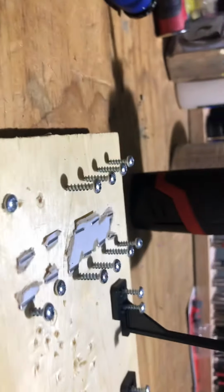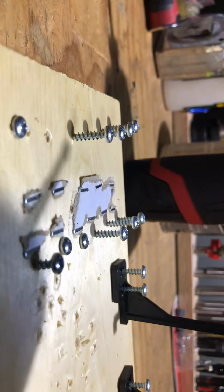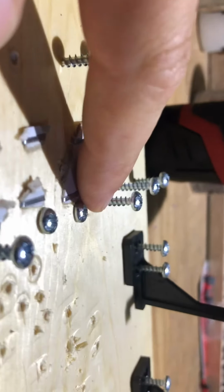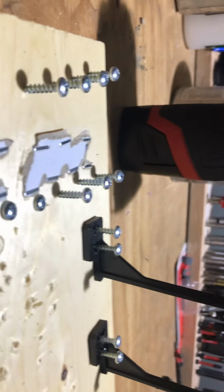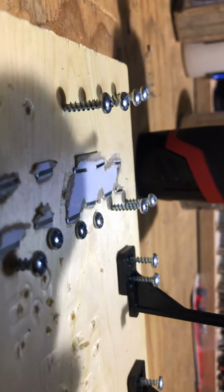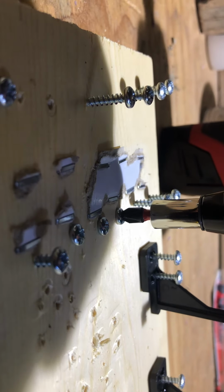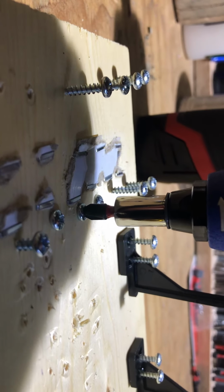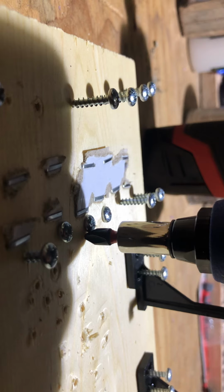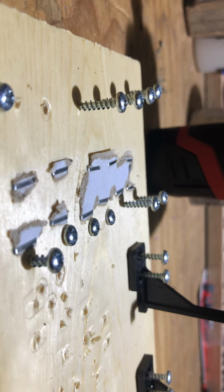So setting three. That's looking pretty similar between the 5 inch-pounds and number three on the clutch. We'll do one more, setting four. Okay, let me see if that'll torque out. Okay, that's at least five. That one turned. So four is at least 5 inch-pounds, and clutch three is less than 5 inch-pounds. I'll stick with number four because it at least gets us 5 inch-pounds.